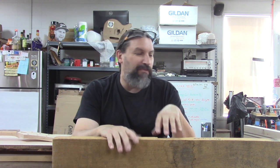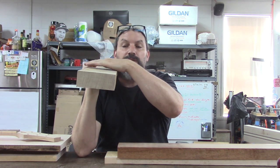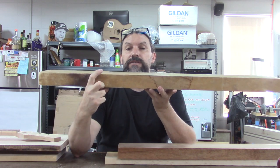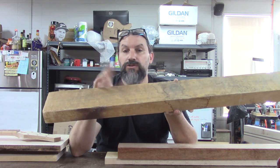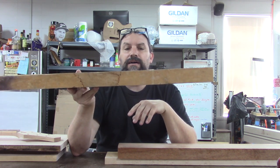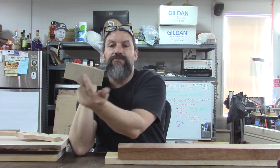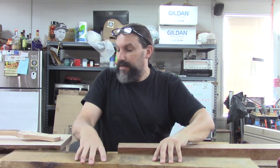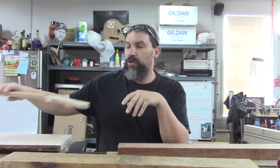I've done a bunch of videos about quarter-sawing, flat-sawing, rift-sawing, vertical grain versus quarter-sawn — you can look all that stuff up. For the sake of this video, brevity is going to be important. You want the grain to be going vertically on your neck blank, and then the fretboard would go on this side. This is a piece of white limba from my secret stash — eight-quarter material, meaning it was two inches before milling. At Gibson, because their headstocks are 14 to 17 degrees, this would not be big enough to have a quarter-sawn or vertical grain orientation with that very angled headstock.